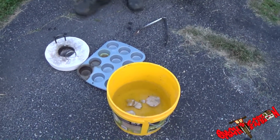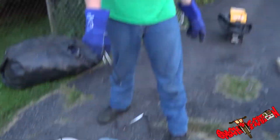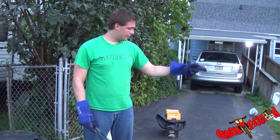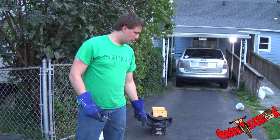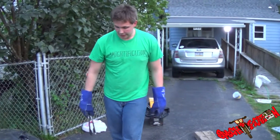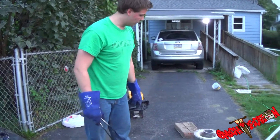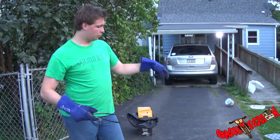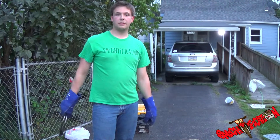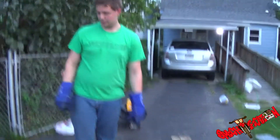Alright. So the double blower system — the two intakes — does work. I killed the hairdryer, so I'm going to have to do something different about that. That's what cut it short. I have a bunch of slag in there; all the slag pretty much stayed in the crucible. What happens is it will just flake right out of the crucible, so we'll be fine. Thank you for watching and subscribe. Don't forget to like the video if you like it. Have a nice day and God bless. Bye.